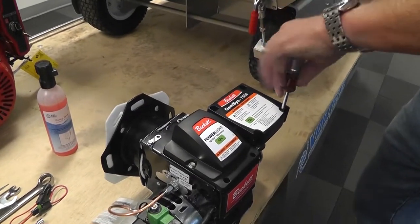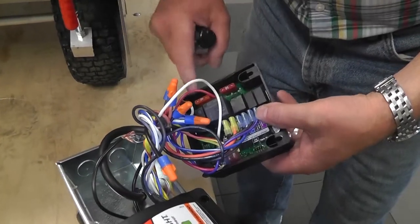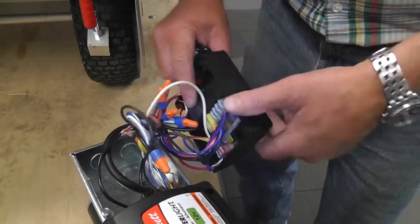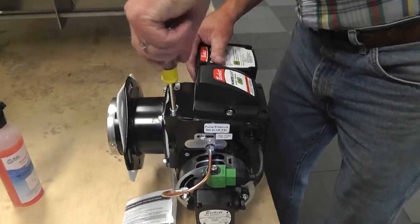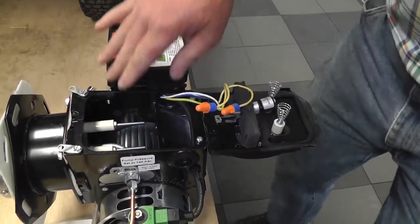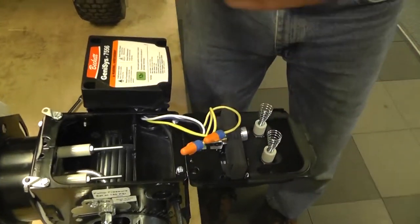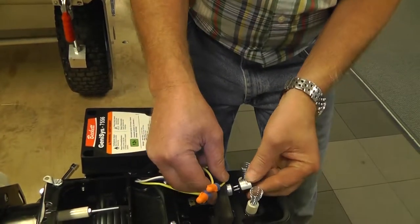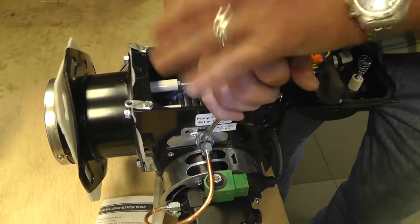The next step would be to go into the controls on the burner. You loosen up a screw here and a screw opposite, and you slip that off — it will pop right out. There are also controls in here: a 10 amp and a 40 amp fuse, which are a backup to what we have over there, and you would check those also. This is where all the controls and the timers are to run the burner. If we want to change the nozzle, we loosen this screw and that screw — these automatically spin over, giving access to where the nozzle and all your burner parts are. Right here is your eye, which controls if the burner's on or not — it will not pump fuel in there if the burner's not on, and that will need to be wiped out and cleaned every so often.